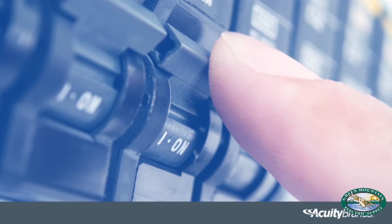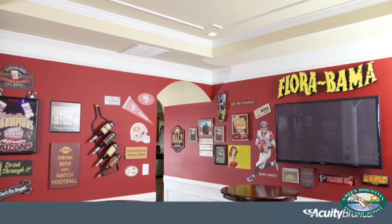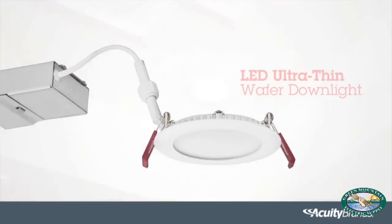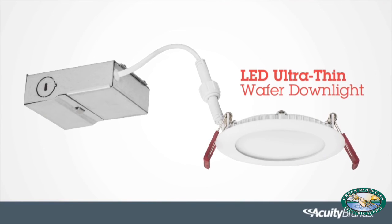Turn on the electricity at the circuit breaker box and walk back into the room where the fixture is installed. Turn the power in the room back on and be sure the module illuminates. This completes the installation of the LED ultra-thin wafer downlight from Lithonia Lighting.